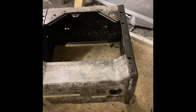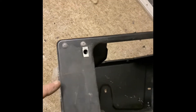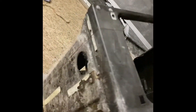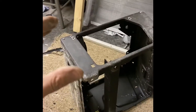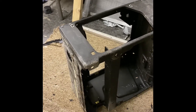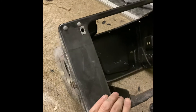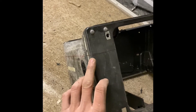Step one: remove the plastic. I've drawn a line all the way around the box - measured 60mm down from the top, then put a straight edge on and drawn all the way around. The bracket is going to have to go on top of that, which makes it about 40mm, meaning overall my seat will probably drop about 20mm. It's something - I don't want to go too much, but if I can at least keep it a little bit lower than it is now, and certainly not higher.